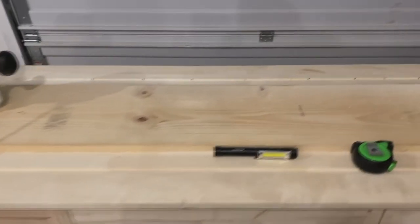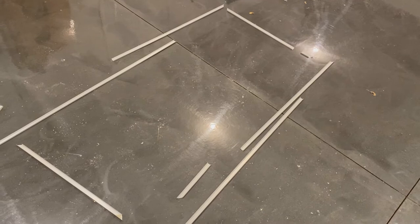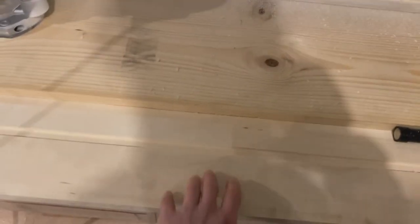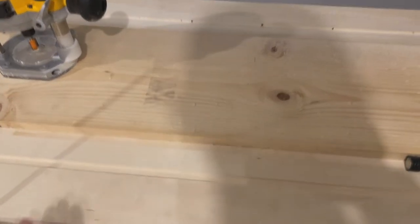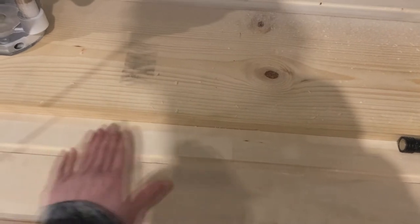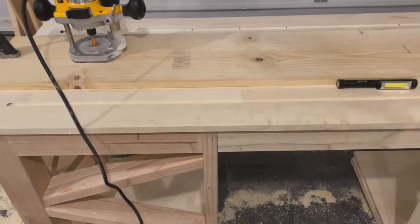Another thing we did was, I don't know why I didn't plan for this originally, because this is 2021, almost 22, and we have great things like epoxy resin. I was originally using these channels, and that was a huge mess. They're probably 4 feet out of the box, to be 6 feet, so I had to cut them, and I didn't even think they were gonna line up. So what we're gonna do is pour opaque epoxy resin down into this channel, and then sand off whatever spills over, and the LED strip will be underneath it. It'll give a nice diffused opaque look, which is what I was going for to begin with, and it'll be more flush with the desk.